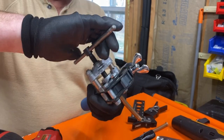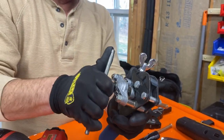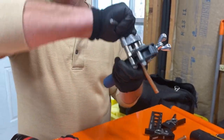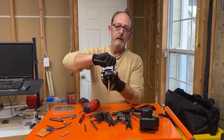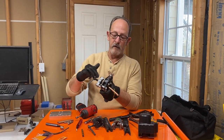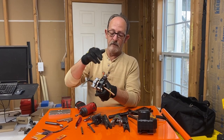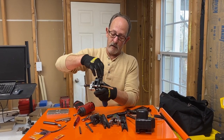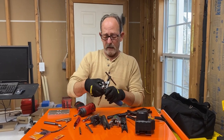Now, the problem with this one here is you'll never consistently make the same flare twice. So if, let's say, you're on the phone and you're having a heated argument with somebody and you get upset and you just keep torquing down, the problem is your flare is going to be too big.